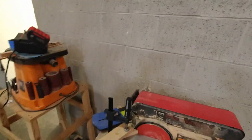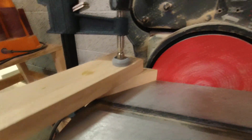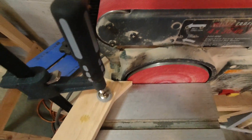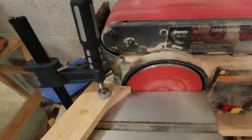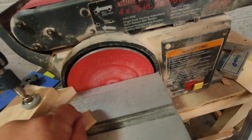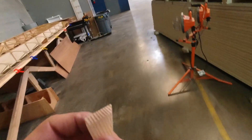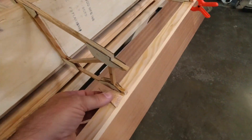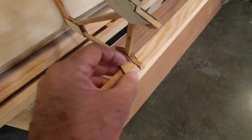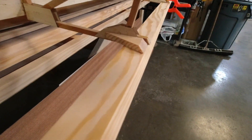What I've done here is set up a piece of 45-degree material and clamped it down. That allows me to just push each piece up against it and easily sand my 45-degree angle. I did one here as a test — so that's right here — and how it works out is it just sits right in here and follows the 45-degree that's already there. It just looks like that.